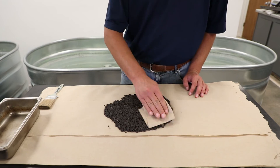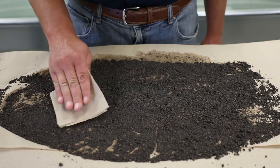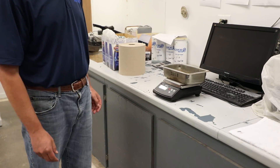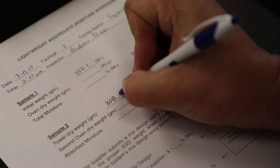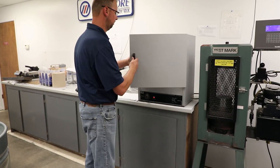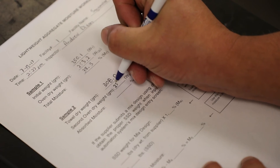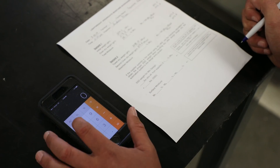This process should be conducted as quickly and carefully as possible. Repeat the padding and spreading of the sample until no further moisture appears on the clean paper towels. Immediately weigh Sample 2 to the nearest 0.1 gram. Since the surface moisture has been removed, this weight represents only the moisture that has absorbed into the sample. Record this weight as W sub TD. Place Sample 2 in the oven or hot plate and dry it to a constant weight so that the loss in weight between subsequent measurements does not change by more than 0.1 percent. Measure the weight of Sample 2 to the nearest 0.1 grams and record the weight as W2 sub OD, Sample 2 oven dry weight. Calculate the absorbed moisture percentage of Sample 2.